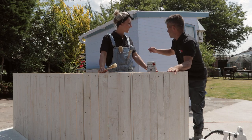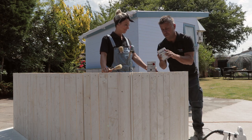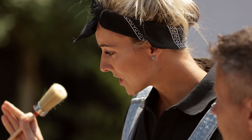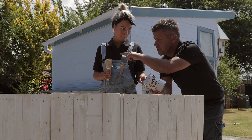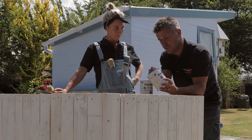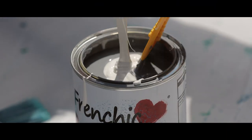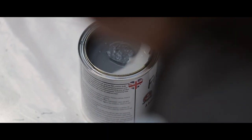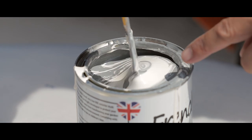Laura's given the summer house two coats — it's weatherproof. The bar has had a base coat of Cream Dream. Laura suggests painting it in Greyhound and fading it through to Cream Dream for an ombre effect on every individual panel. To achieve this, start with Greyhound and mix in about five percent Cream Dream into the same tin each time, painting each strip individually. Always wipe your brush clean before painting each slat. An ombre effect is easy to create over a large area this way.